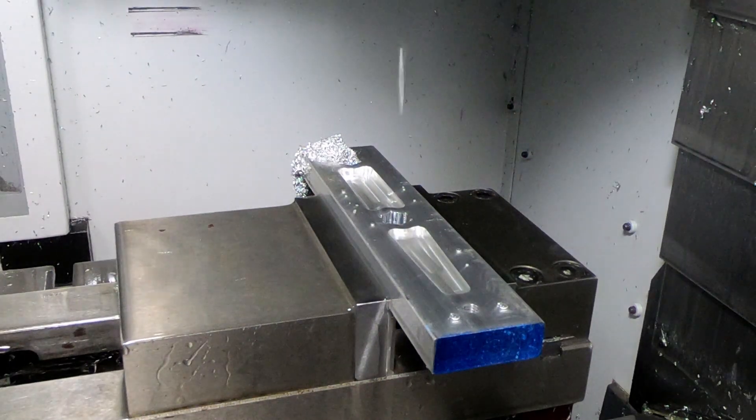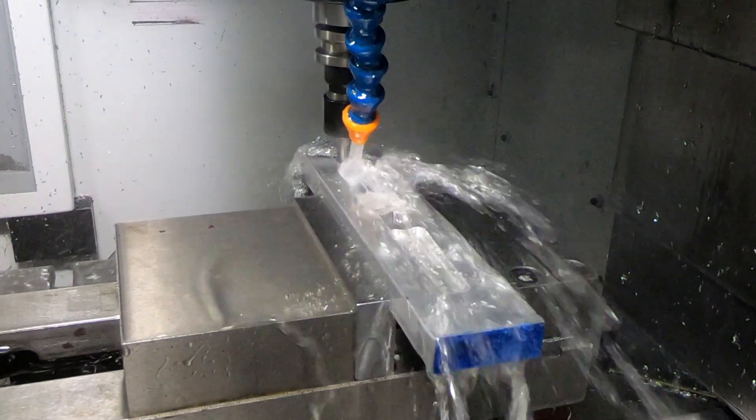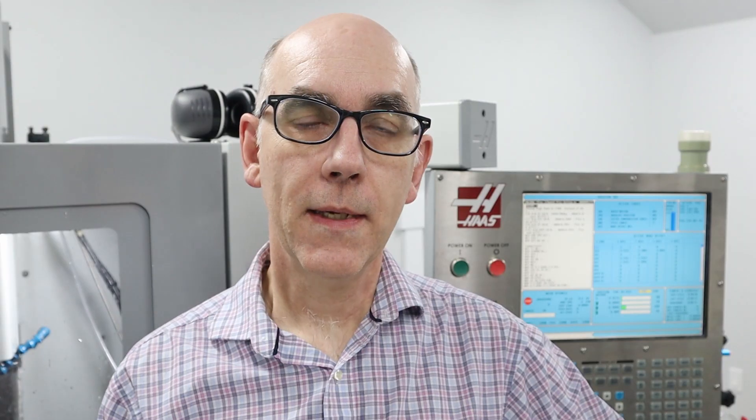Partway through making the part, I had a problem. As you can see, it opened up the first hex hole a lot more than I expected it to, and you can tell that from the sound as well. The problem was a result of having the wrong tool. I chose tool three, which I thought was a three-sixteenth inch end mill, but that wasn't correct — it was actually a quarter-inch end mill, and my three-sixteenth inch end mill was in a different slot.